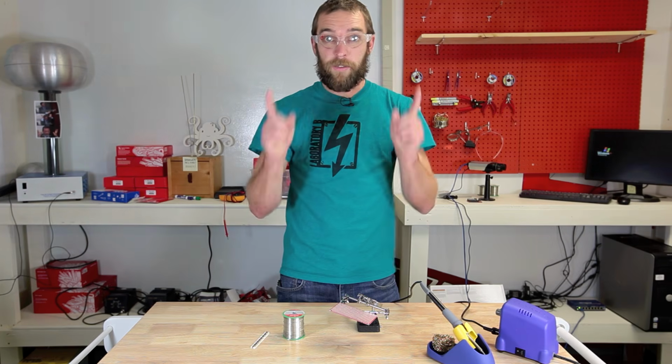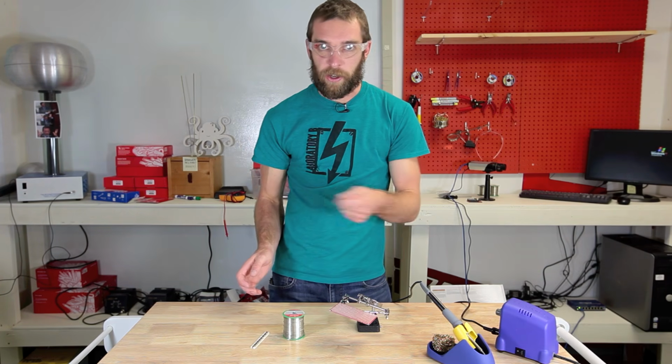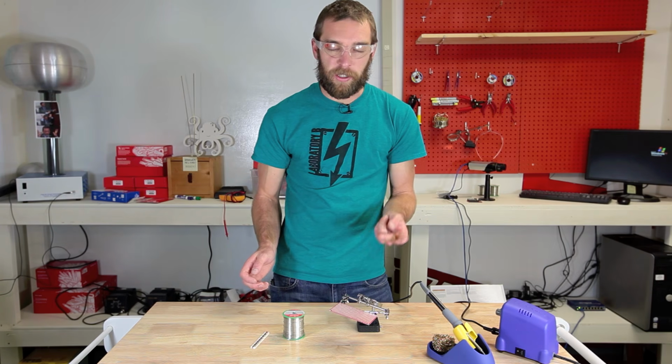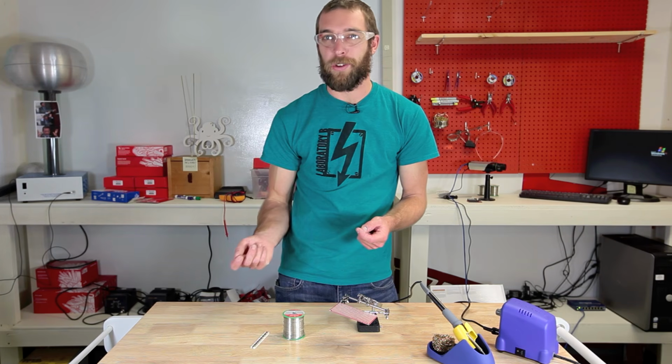and that's where I'm going to be actually soldering to. Don't forget safety glasses. Soldering is not inherently dangerous, but you are waving around a soldering iron that's several hundred degrees Fahrenheit, so we do want to be safe. And once we start snipping the leads off of things, there are little metal bits that can go flying everywhere, and the last thing you want is one of those sticking in your eye.